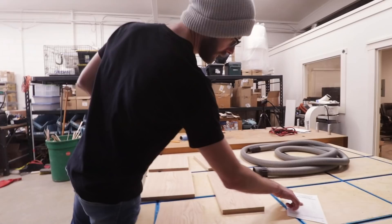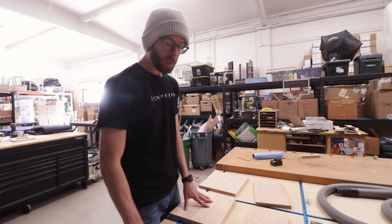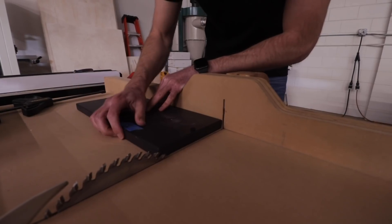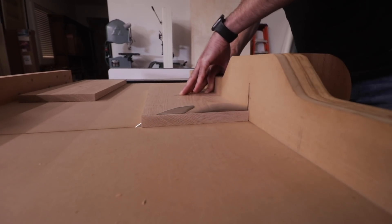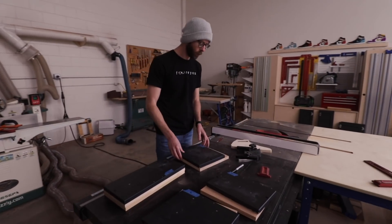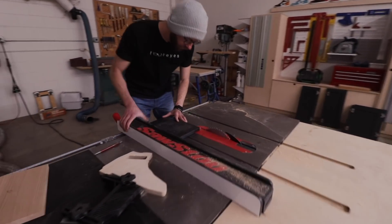Enough goofing around - let's get back to work. These are all sanded on the front side and ready to go. Now we've got to cut them to their final size. What we're actually going to do is use the drawer faces that we pulled off of the cabinet so we know we're cutting them exactly the same as what they were. We got them all cut to finished length, now we cut them to finished width doing the exact same thing - we'll use the old faces to set up the fence.